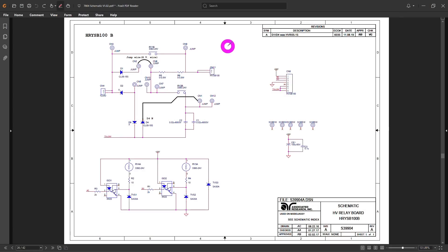Let's take a brief look at the daughter board that sits on top of the board I just replaced. That board is responsible for conversion of AC to DC — it basically has some relays and some rectifiers to achieve that, but all of these things have to work at 5,000 volts. It's a very simple board in a sense, but the difficulty is in making it work at these really high voltages with the appropriate breakdown. Anything entering that board is going to be an AC signal directly from the transformer — our AC 50 or 60 Hz. Normally this path is enabled: this high voltage relay is closed, allowing the signal to go right through it and jump out onto the other board. There, you have a resistive divider to divide the voltage down, close the loop, and stabilize that AC signal anywhere from roughly zero to 5,000 volts. But when you want a DC signal, a different path has to be enabled — this relay opens, and this relay closes, giving a totally different path for the signal to follow so you can rectify it onto these capacitors.